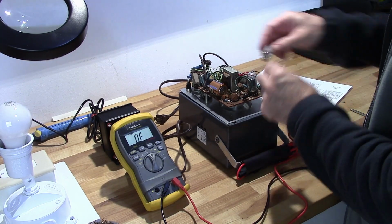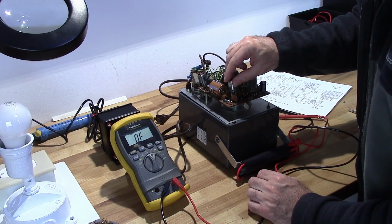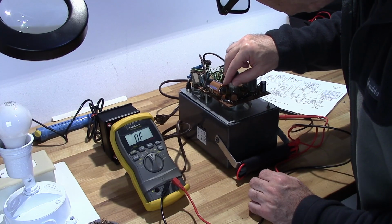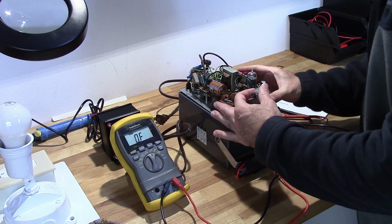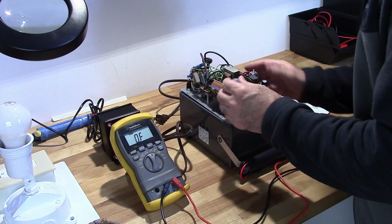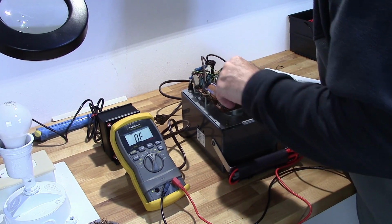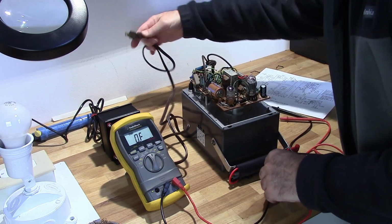And just to make sure, I'm going to go ahead and hook this up, make sure I've got 6.5 volts at least on pin 4. So I've got this thing, it's already turned on. I hate doing that, but the way I've got this positioned, I've got this thing sitting in the case like that. It's unplugged right now, by the way. So having that sit in the case, it's helping me to stabilize this. I might short things together. Okay, tube back in there. Now, with that being said, I can go ahead and plug this in.